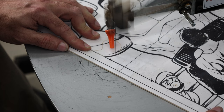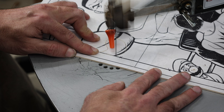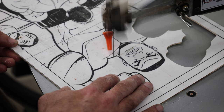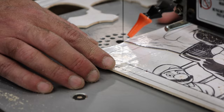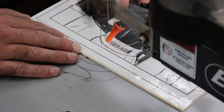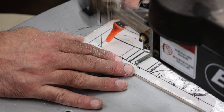For this portion, and really most of this project, I'm going to be using a number five crown tooth blade. I really like that blade — it gets really clean cuts on the front and on the backside. Don't really have to do any sanding whatsoever when I'm using this. The only time I'm going to change blades is if I'm doing tiny detail work — I might jump down to a number zero or a number two blade — or if I start dealing with super dense tropical woods where a crown tooth just isn't going to cut it. No pun intended. A little pun intended. Then I'll jump over to a reverse tooth blade instead, something that has a little bit more toughness to it.